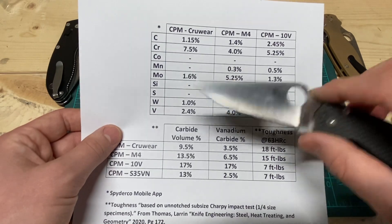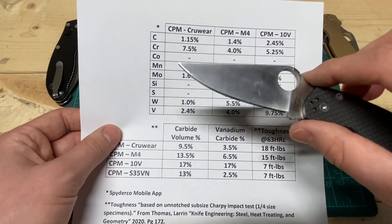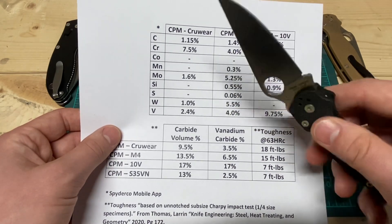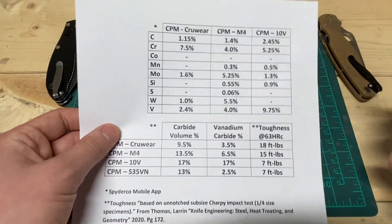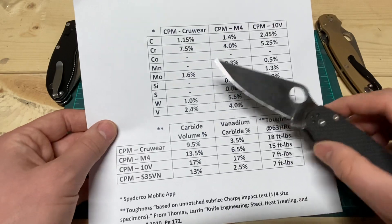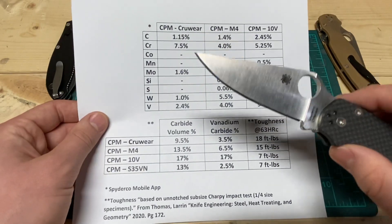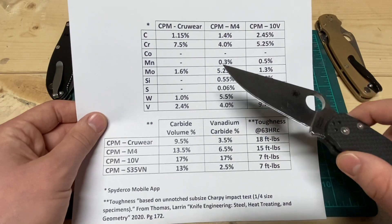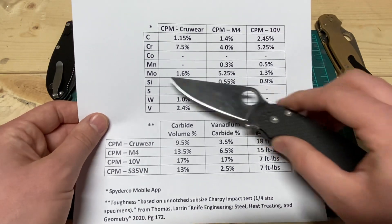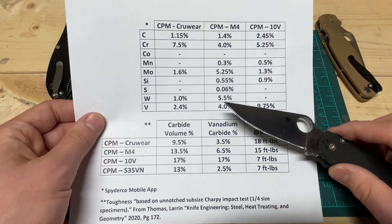More specifically for the design of M4 is its hot working hardness. M4 is designed for tooling, and specifically high-speed tooling, which is why it's generally known as a high-speed tool steel. That means tools made out of this can spin very quickly, work fast, and get hot without losing their heat treatment — and that's what molybdenum helps with significantly.